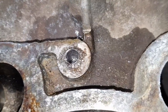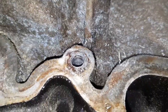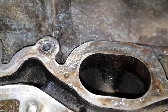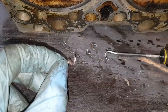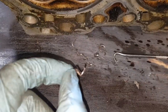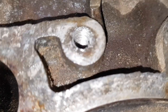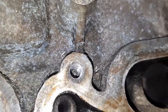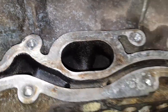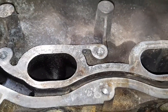After drilling these two holes out I've removed the jig. Now you can see what's left in there. After finishing drilling the remains of the bolts out, I managed to pull the threads out — this is what remains of them. Some of this came out as one piece and I ended up using a couple of picks to get the rest of it out. When that was done I just chased the threads through with the supplied M8 taps. These are the two holes — the taps run all the way through to the bottom of those now. The repair's finished; I've now got two nice clean holes. I'll blow them out with an airline and clean them up properly before anything goes back together.